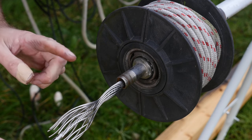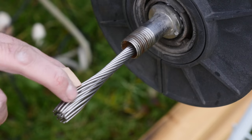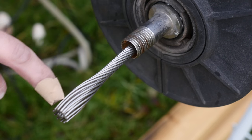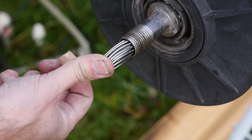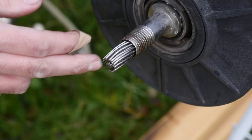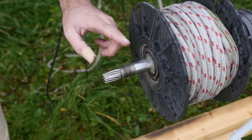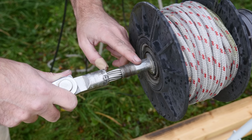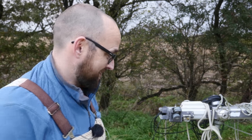I just want to show you something. There's a small handful of manufacturers of these swageless fittings. The cone I got from the rigger said Stalok on it, so I followed their instructions and I've got about three millimeters of wire poking out the end of the cone. What you're about to see now cost me hours of head scratching, because the bottom part of the swageless fitting doesn't reach the threads. This was quite the head scratcher because all the videos I'd watched on YouTube of people fitting these swageless fittings made it seem super easy.